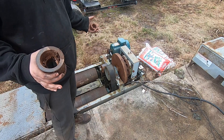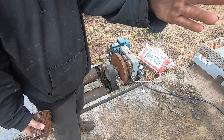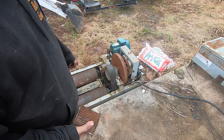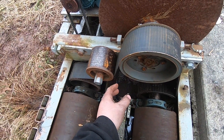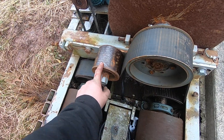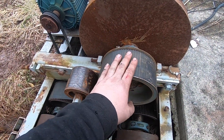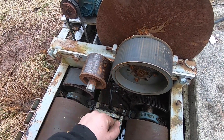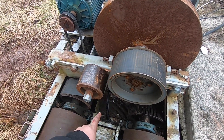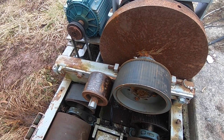When placing this dyno in your backyard, realize that if something lets loose and explodes it'll go in a specific direction, so orient it so it doesn't hit your house or your neighbor's house. On the actual belt system — it's rusty from sitting but cleans up after a couple pulls. I did build a custom tensioner — extended it and modified it to work with the pulley. There were stiffness issues: on a high torque V8 hit you'll flex the tensioner back and get some belt skip, so I welded a nut on here for a planned support, though it hasn't been a major issue lately.